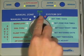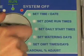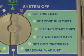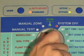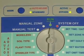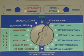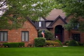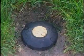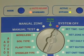You will notice that the programming dial is laid out in a logical clockwise sequence. For automatic watering, always leave the controller in the run position. The mode LED displays green when the dial is set to the run position. You can use the system off position on the dial when you want to cancel all automatic watering for a period of time. The SmartLine will continue to keep the correct time and will retain all programs. This function only interrupts power supply to the valves. When the dial is set to the off position, the mode LED will display red.